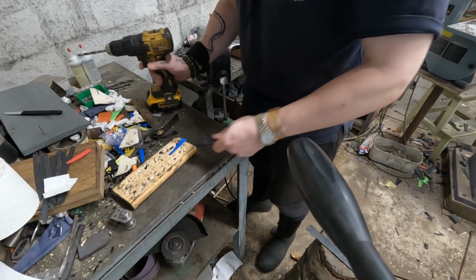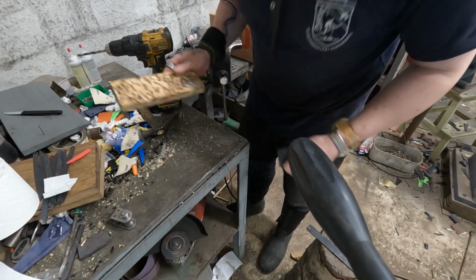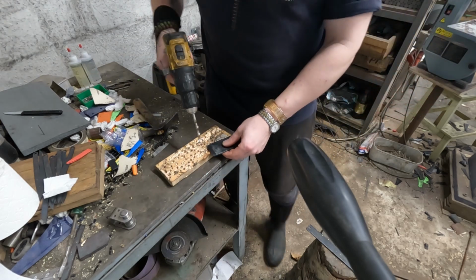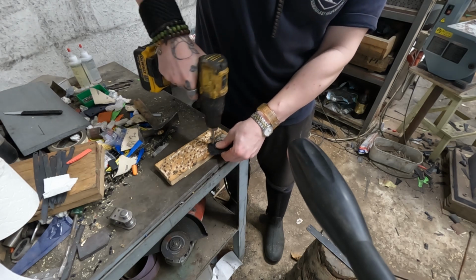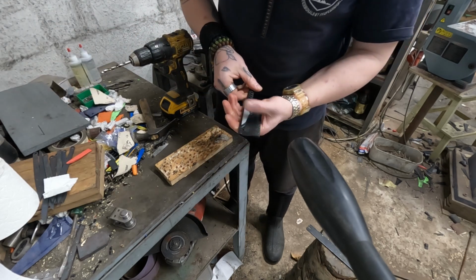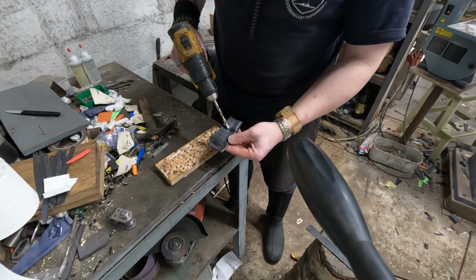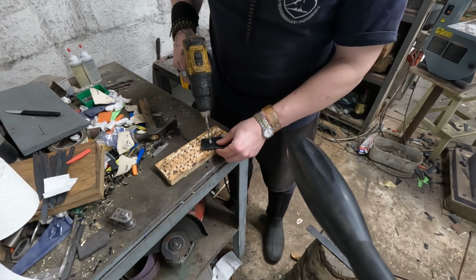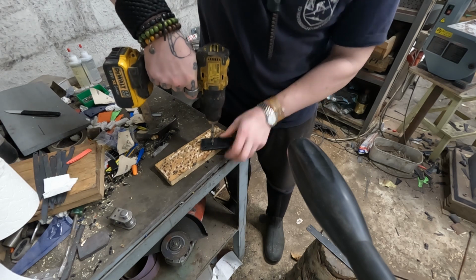So here's our classic little thing there. There's a couple places where I drill the holes. I'll just throw that on the floor. So I do one quite close to the tip. Like that. And then the distance, again, from here to the second eyelet is what actually creates the lock. So the further up you drill the second hole, the further up the other eyelet is, the tougher the lock is, and the thinner your material needs to be. So I've found that somewhere around here is the best.